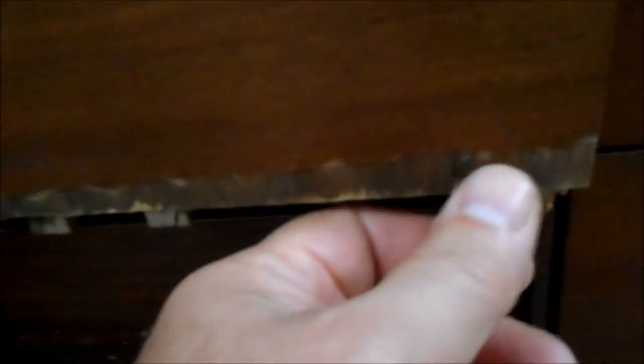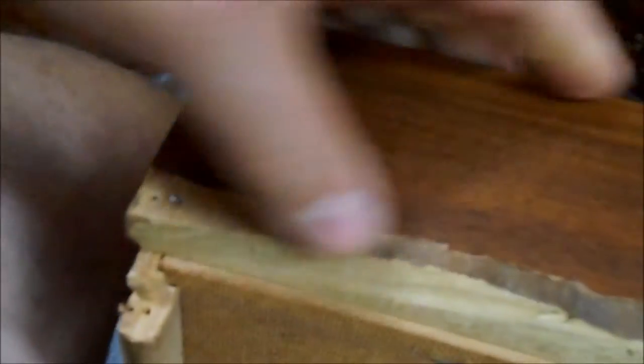When we open this drawer, we see we have a worn hinge here that's loose, and we'll repair that. And then these drawers took a beating, particularly this one. I don't know if you can see it, but the veneer is actually gone here. So this is what we're going to be doing first thing today, is to inlay a new piece of walnut veneer here. We have some damage to the substrate as well. Fairly significant missing piece here, so we're going to have to come up with some kind of a method of restoring the substrate before we put the veneer on, but we'll take care of it. And there's another veneer piece there, and there's some other finish issues.